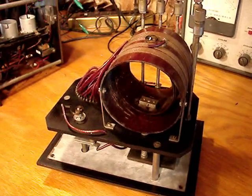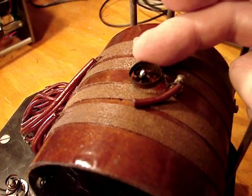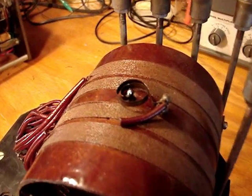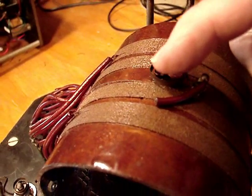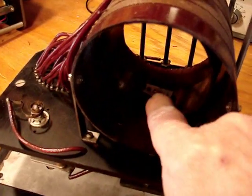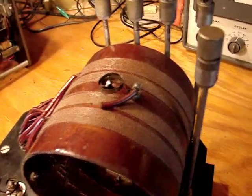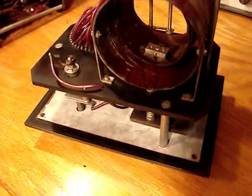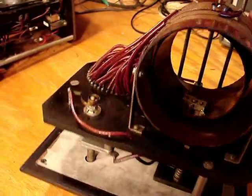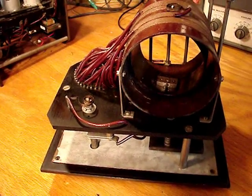Here's the tuner assembly removed. I've checked all the connections, especially these little spring connections that sat around this center post. Checked them very thoroughly with my ohmmeter. I touched up and cleaned this one, making sure I was getting zero ohms. I also measured down through the coils — it measures 2.1 ohms. I rotated it to make sure I wasn't losing connections. I checked virtually every connection on the tuner assembly to make sure there were no high resistances or open circuits. I believe it's as good as I can get it.